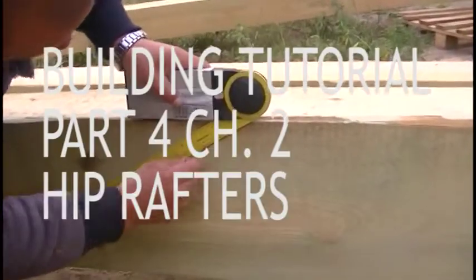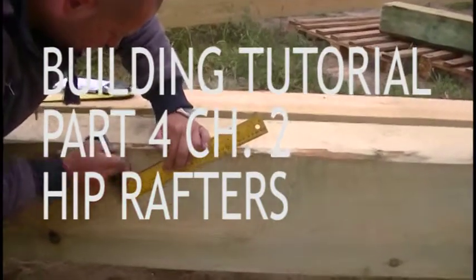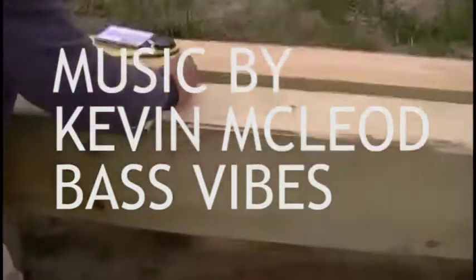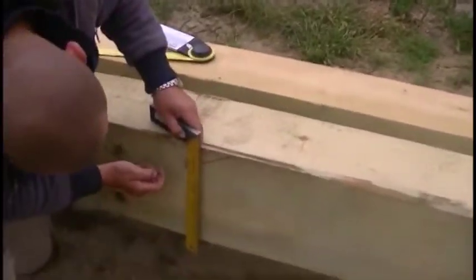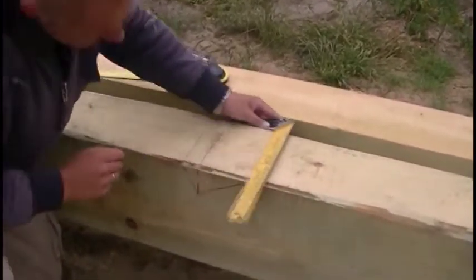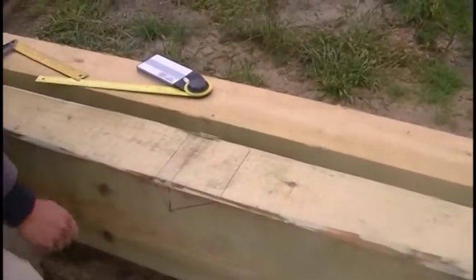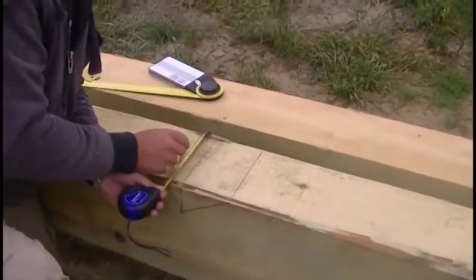And now we begin to build a proper truss. Work begins by preparing the corner rafters. They consist of timbers section 36x18cm, more than 9m long — so really powerful, very heavy beams. Using the corner rafters we will build the main truss that supports the entire roof structure.